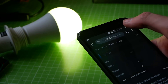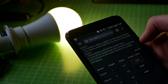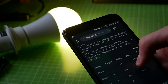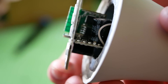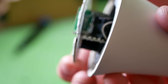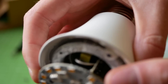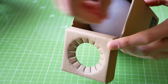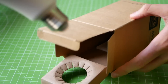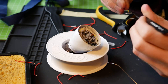What you see here is the result of a 13€ purchase on Amazon and one afternoon of work. It looks like a normal light bulb, but it can be used to effectively disable selected WiFi connections for as long as you choose. In this video we will have a look at cheap WiFi-enabled light bulbs, especially those with the ESP8266 inside. I will give some advice on how to find and differentiate these hackable devices from other ones and how to flash your own firmware onto them. My hope is that by the end of the video you will have a different view about smart devices.